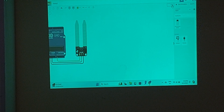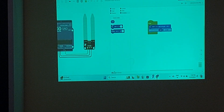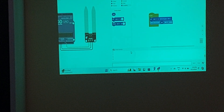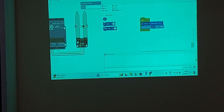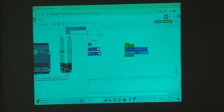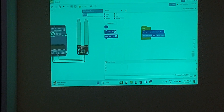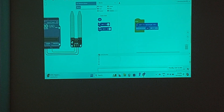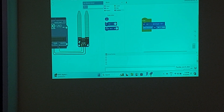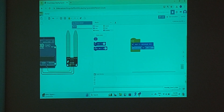I will go to the code window and start simulation. I go to the serial monitor at the bottom — the value is Zero. When I click on the sensor and add some virtual water, the value increases to 30. The maximum value observed is 876. So the range is 0 to 876: fully moist is 876, completely dry is 0. I will now put a condition: if greater than 700, moisture level is high and red LED should blink; otherwise, green LED should blink.